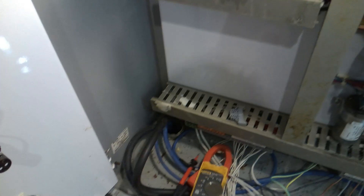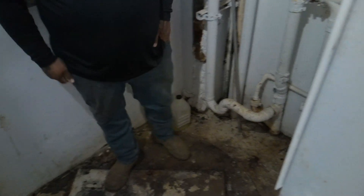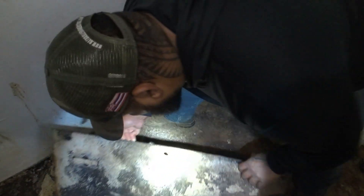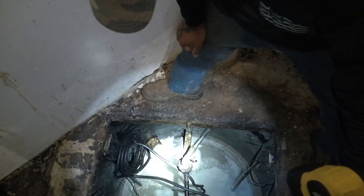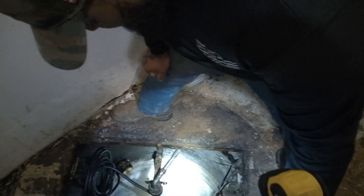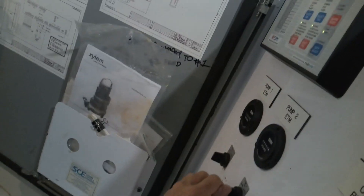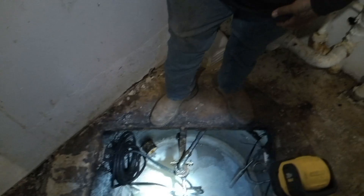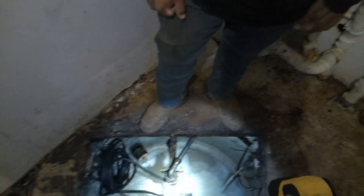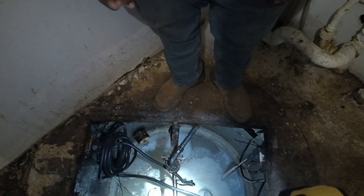How often does this sump run? It must run a few times — that's for the kitchen upstairs. Is it hard to look in with that lid? That's nice, it's soapy. I'll take soap to solids any day. Let me pump down with number two because what I want to do is turn off the power and check the capacitors, and then try and run — because they're single-phase motors, so if the start relay is bad, it won't run.